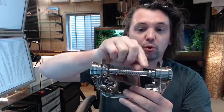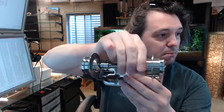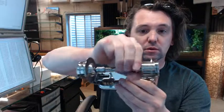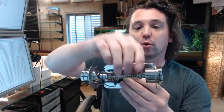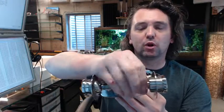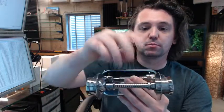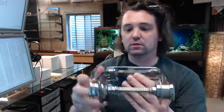You can accomplish that by rotating this knurled nut here, and you can see as I do that it moves this washer out — you have got a half inch adjustment on that, from 4.25 to 4.75. If something is too tight the toilet paper tears; too loose and it freewheels. So you or your staff, whoever is charged with this, will be able to set that.